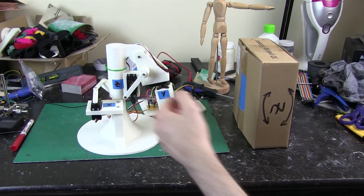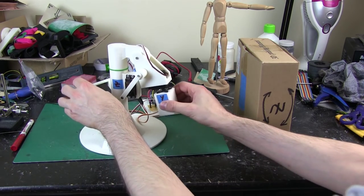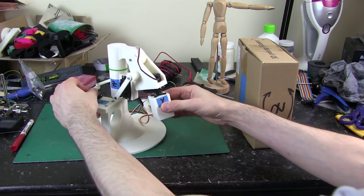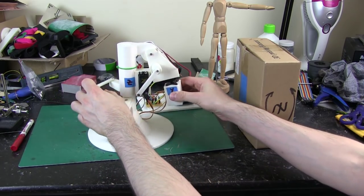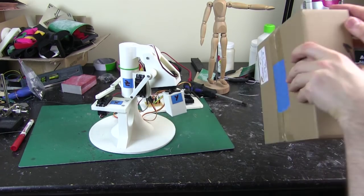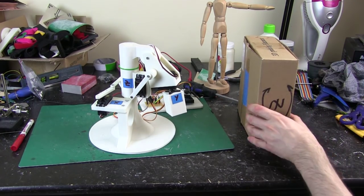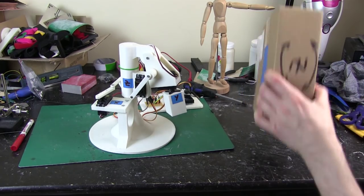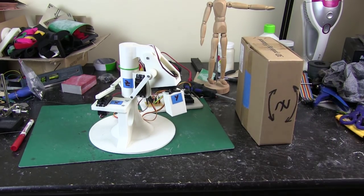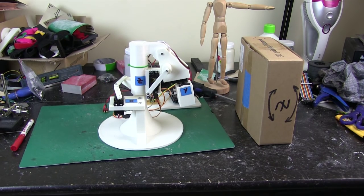But now looking at the arm, that's not so bad, because that's what I described before, where I want to turn the arm forwards, and I want to move Y at the same time to give me the effect of moving my arm like this. So that's why you get data out of X and Y when your arm is this way and you only rotate apparently in Y. So I should be able to translate those angles directly to the motors and it roughly follow what I'm doing, and that's why I've designed the arm that way.